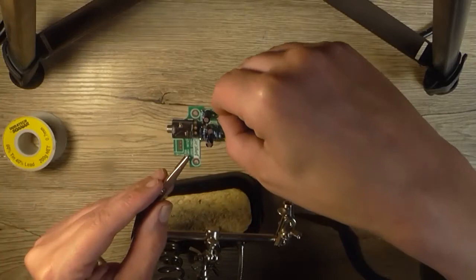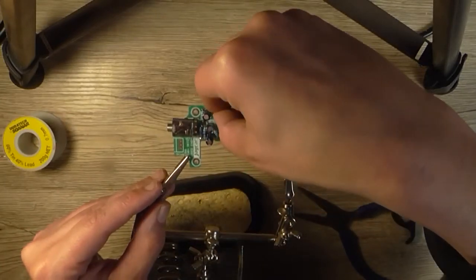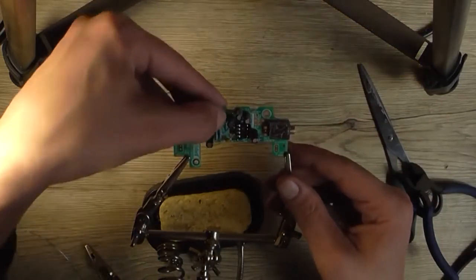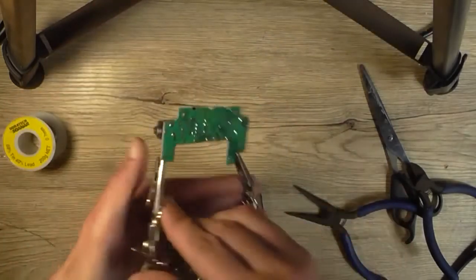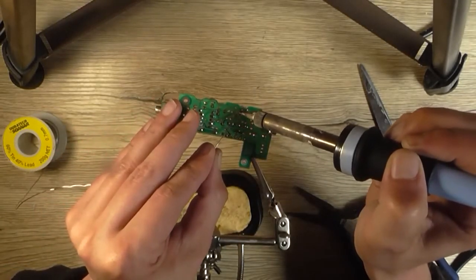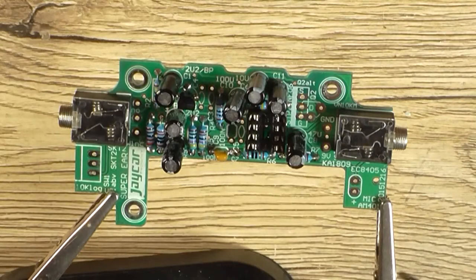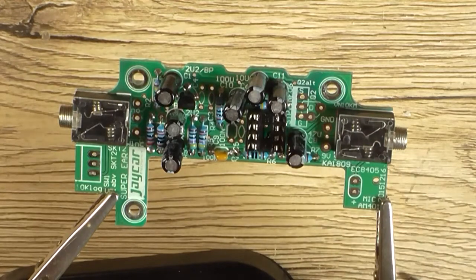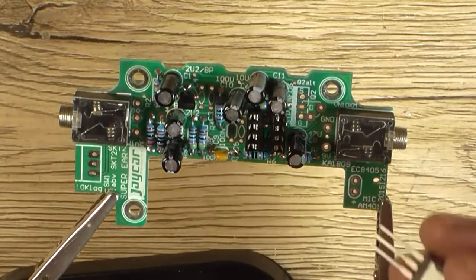I just have to double check the instructions for that. Make sure you don't have to do something funky with it. I don't think so. Alright, so that's the transistor in. That can be soldered. Right, I just read the instructions about the MOSFET and it didn't say anything particularly about how it's mounted. They did say that there's two different types of footprint here for two different types of MOSFET. It's only drawing about 7 or 8 mA through the transistor, so either would do.